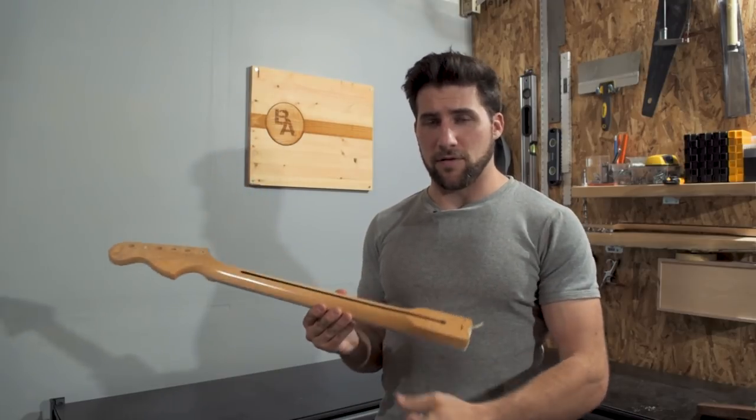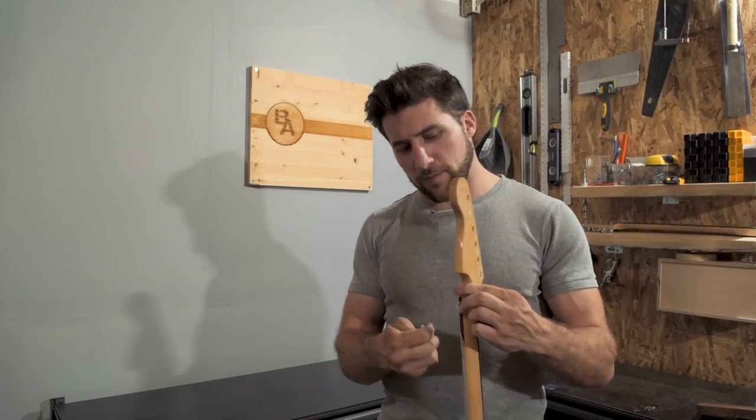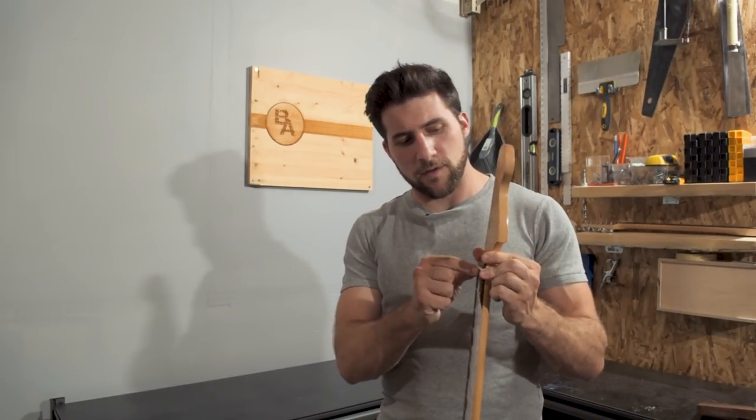Really, that's all there is to it. When you're wondering — can you use the same painting techniques on a neck as you can on a guitar? The answer is yeah, you sure can. I wouldn't recommend going with gloss finishes, but that's a matter of personal preference. Really, you're just finishing another piece of wood that happens to be a guitar neck. And you probably don't want paint all over your frets, so make sure you tape those off. Make sure you tape off the heel, and from then on it's your average finishing project.